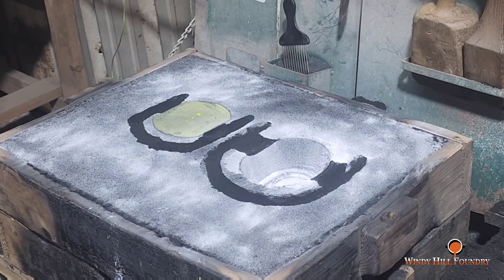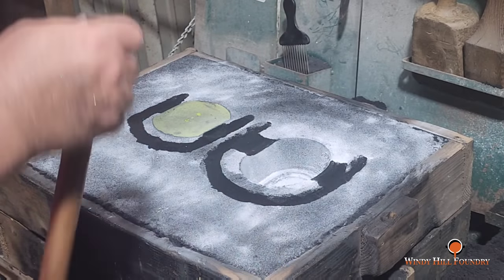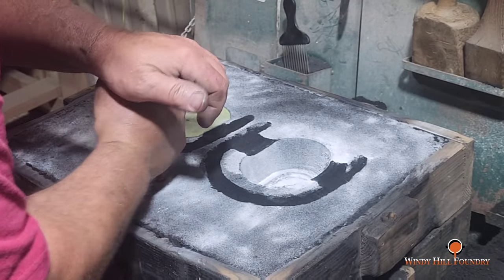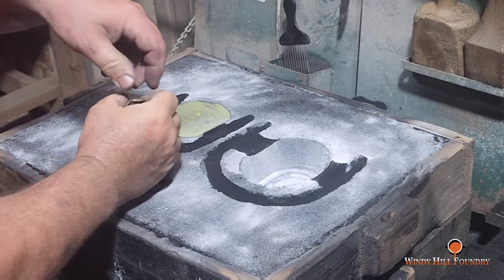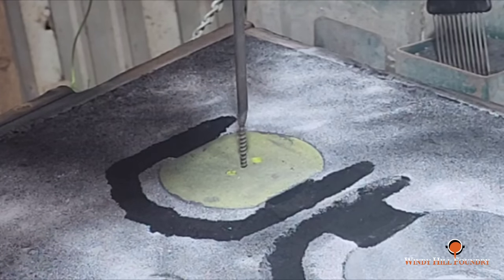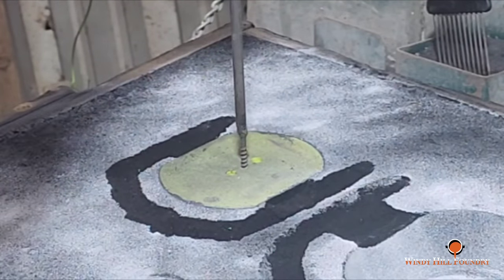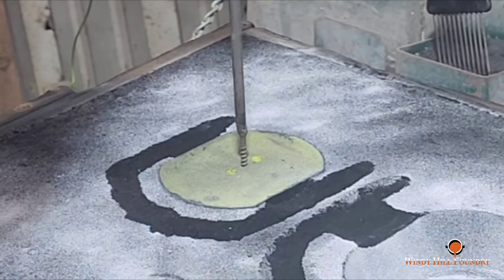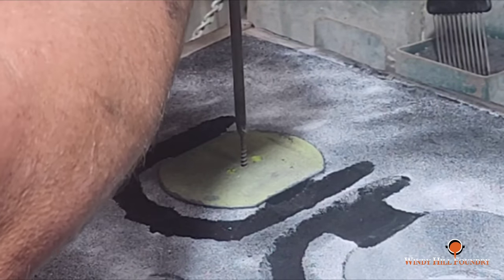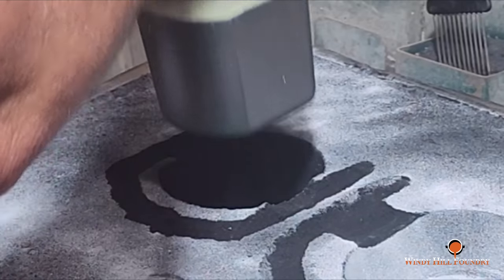Since I am cutting a sprue from the inside out, I'm going to use a parallel tube — it's not a tapered one. I'm going to get it straight through. This is going to channel our iron down through the mold, and we have hit the board down below, so we went all the way through, and that's going in sideways. Let's see if I can just come straight up. There we go.